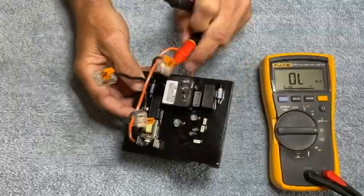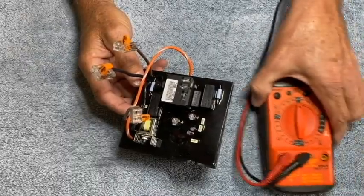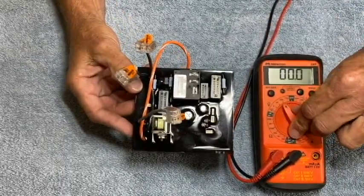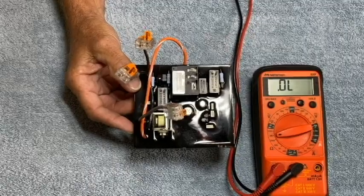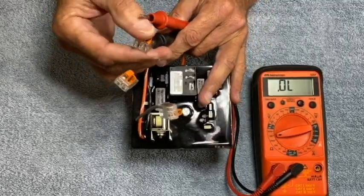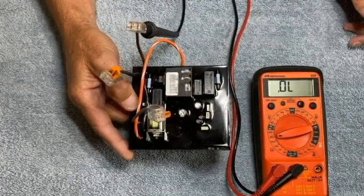So now I'm going to switch to a manually set meter. I'll go ahead and set this into a manual scale of 2000k or 2 million ohms. Now this is not going to be polarity sensitive. If you noticed in the last couple of readings with the auto-ranging meter, we read 3.2 million ohms rising and we read 9 million ohms in the other orientation.